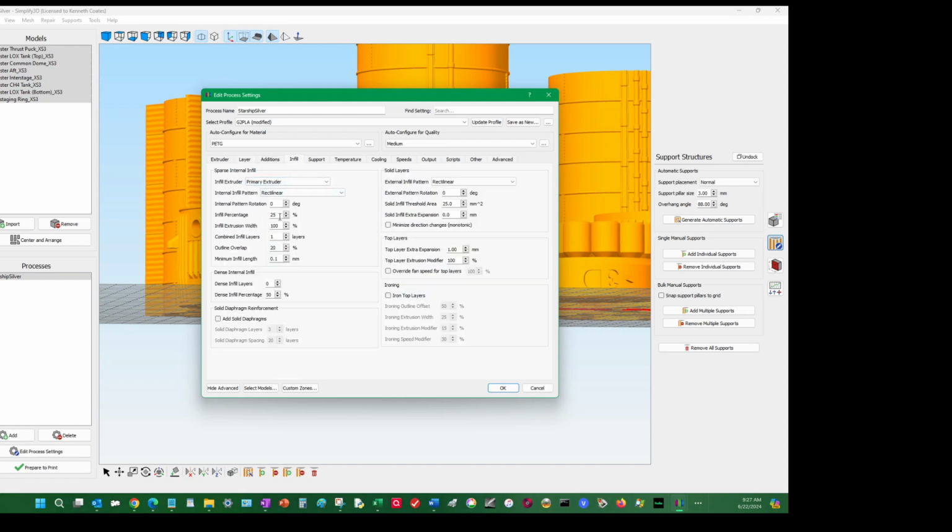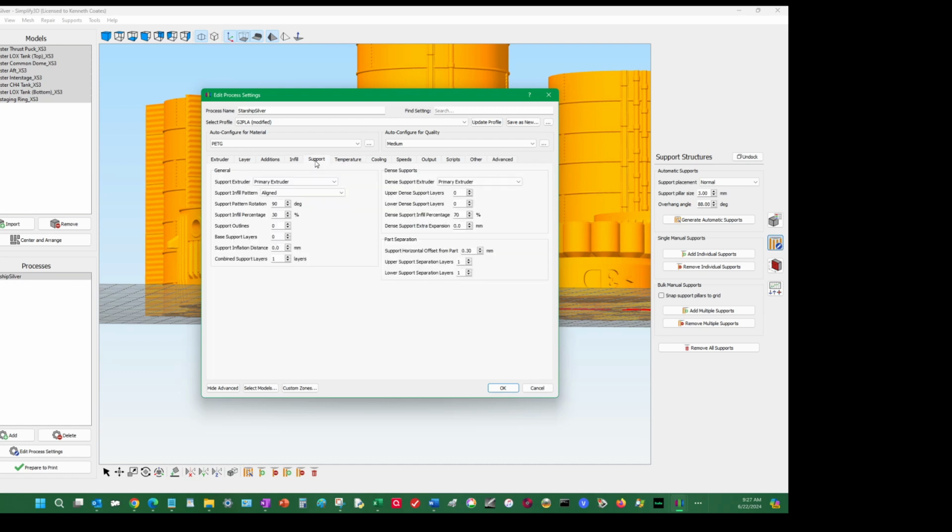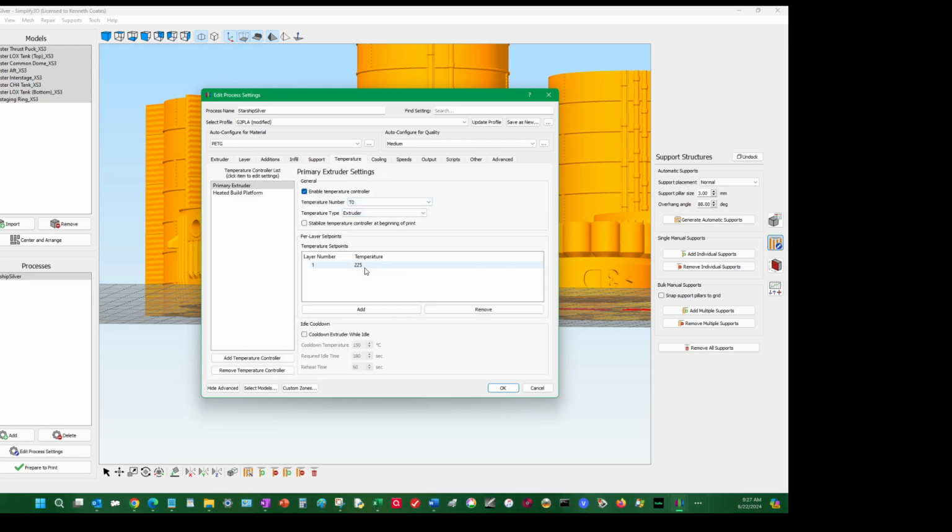And the infill, we have 25% infill with a standard rectilinear pattern. The temperatures, well, the supports, let's look at that. I just look at the defaults for these as far as distance to offset from the part, 0.3 millimeters. So, okay. 225 for extruder, 50 degrees for the bed temperature. That's for the PEI surface. That works great. And for my nickel-plated micro Swiss nozzles, 225 is a good temperature for this filament.